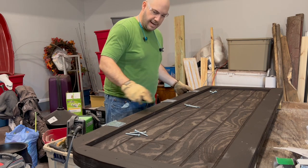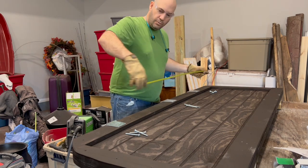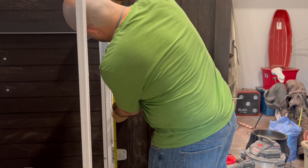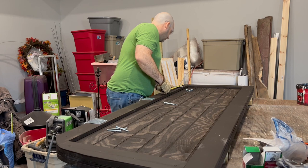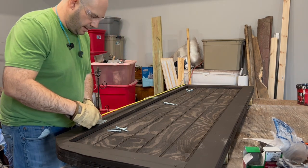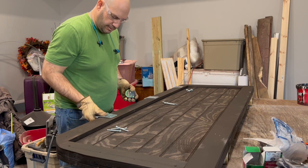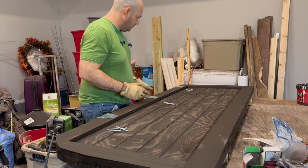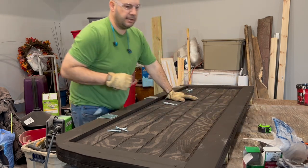I've got my hinges laid out for this door to make sure they look complementary to the other door. I'm going to measure out where each hinge goes — it's kind of hard to see the whole picture, but we've got six, 31, and 53 inches. This is going to make the spacing on the hinges on this door look similar to the spacing on the other door.